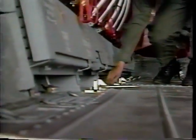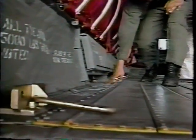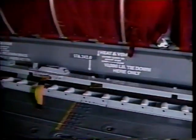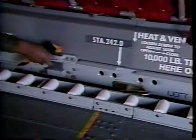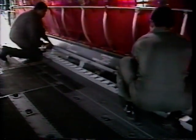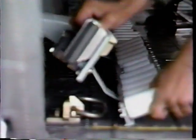Install the rail and roller assemblies. To begin installation of the rail and roller assemblies, angle each such that the rail bumper is clear of or just touching the buffer board. Rotate each rail to vertical. Some fore and aft movement may be necessary if interference occurs. If a floor patch causes interference problems, you will need to modify and repaint the interference area according to HICKS technical manual specifications.